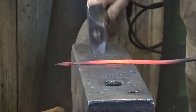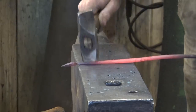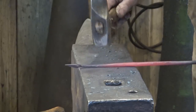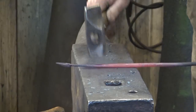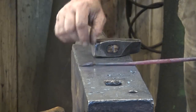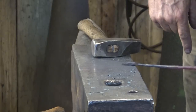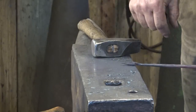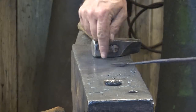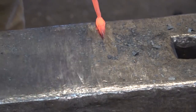If you want a nice blend, you want the round bar from the hook to just look like an extension of the little branch the leaf is on. So for now, let's keep everything fairly straight. Next we're going to spread out the leaf. We're going to start with half-face blows starting right at the edge of the anvil with the corner of the leaf facing up — one of those sharp edges pointing up. That leaves a sharper edge on the edges of your leaf, and that's the reason we do it on the diamond.